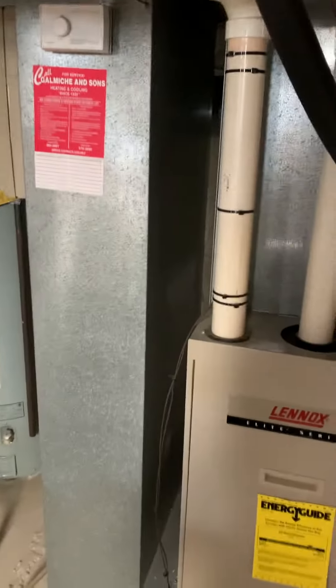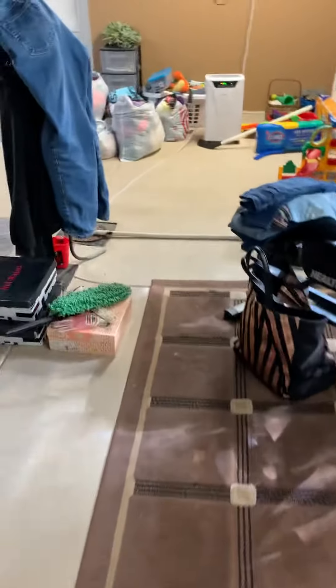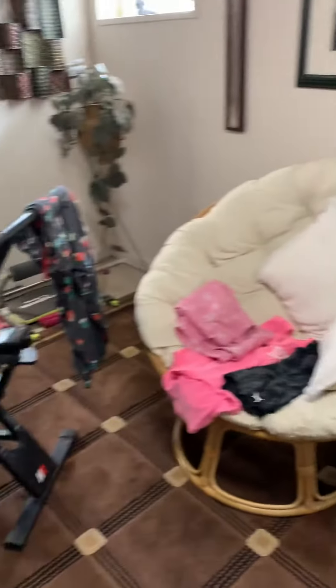It's just coming up through the side, so we can cut that drain and get into three-quarter inch, drop that into the PVC that actually runs the length of the basement and goes all the way over to the floor drain. Just want to make sure we blow that out and then put the proper drain in there. They do have a walkout, so that'll go up.